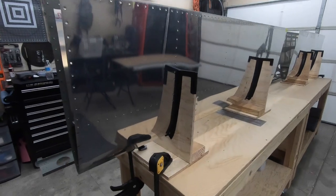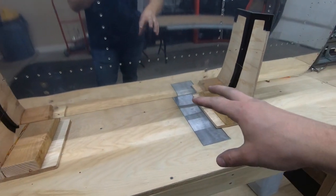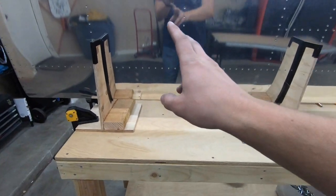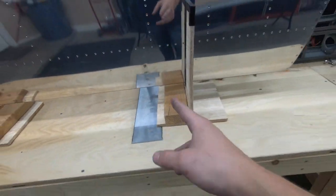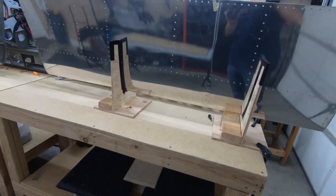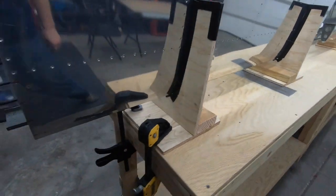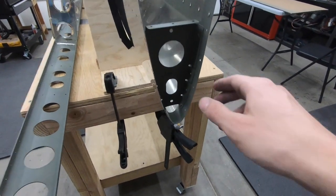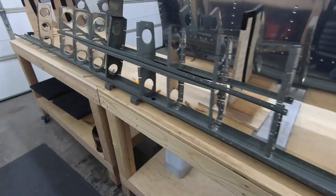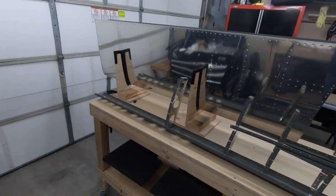It's a little bit later in the night. I went ahead and finished up riveting. I had to use that drywall anchor method in a couple of places — really only needed it for the two middle front nose pieces in each section of the horizontal stabilizer. Overall, pleased with the results. I did have to drill out a couple of them and redo them, but that just comes with the territory and it went through pretty smoothly. The end ones I was able to just squeeze, which was super easy and very pretty looking. The next step involves putting this inner assembly here on the inside.